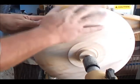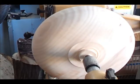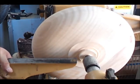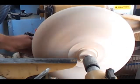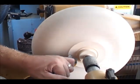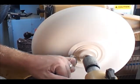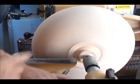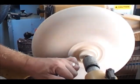A little bit of a ridge there that I need to work out, but I can do that when we've got it turned back around. I'll go ahead and cut in a little bit of a detail for the foot. Since the foot's going to be a lot wider than the chuck, we can go ahead and do that at this point. Try to have the same curve that's on the outside be reflected on the inside of the foot. It just looks nicer.